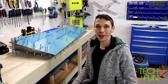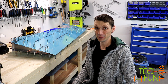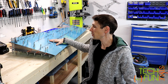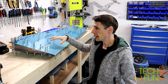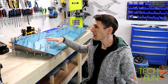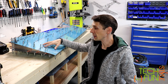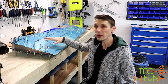Hello everyone! New day and I'm again starting to work on my RV10 build. Today my plan is to continue working on the rudder part. Basically, according to Van's manual, it's going to be a lot of drilling of all holes. After that we're going to be deburring lots of holes, finishing deburring all the skins, all the edges of the parts, and at the end the plan is to prime all inner parts of the rudder.